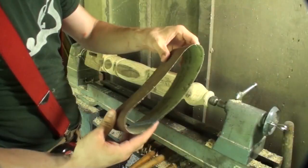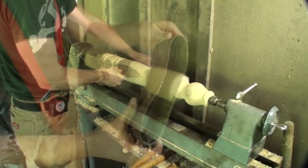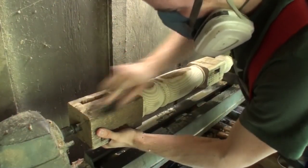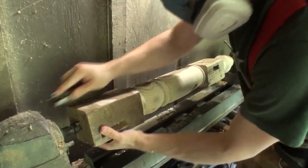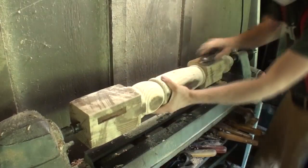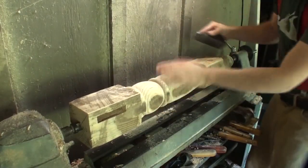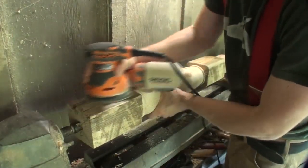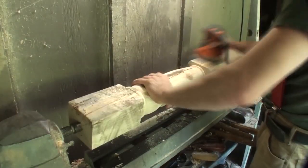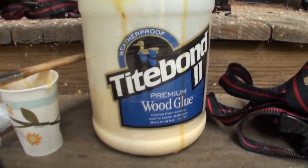A tight joint's a good joint. Next I go ahead and sand the pieces. I use a piece of an old or new belt sander belt — they work great, you can rotate them to a fresh part of the paper, and they're really strong so you don't have to worry about it ripping up in your hands. To sand the legs I do it right on the lathe — it's fast, it's like a little stand that holds it for you and you can rotate it around, using a hand plane when needed.